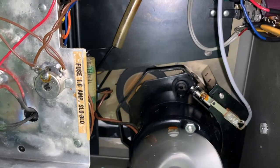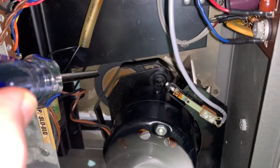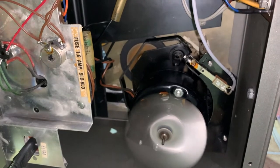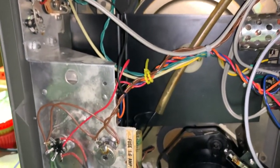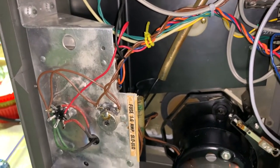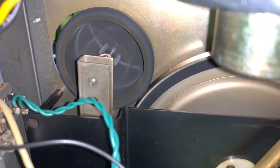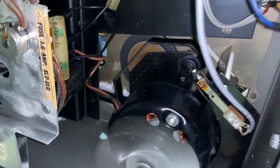This is what the internals look like. The problem I was having originally was any speed slower than seven and a half inches per second would cause that wheel — directly coupled to the shaft on the motor — to slip, and as a result the big flywheel wouldn't turn. Now it works just fine. Going into rewind — notice how the mechanism works. It's very strong and very quiet; everything's been properly lubricated, brakes work beautifully. Here's fast forward — has a brand new belt on it.